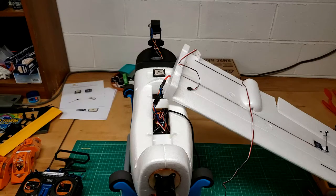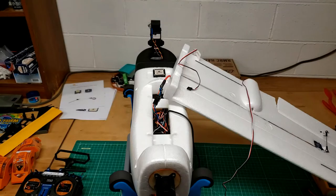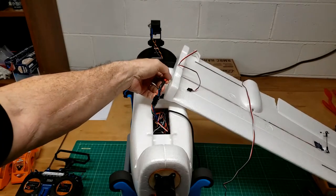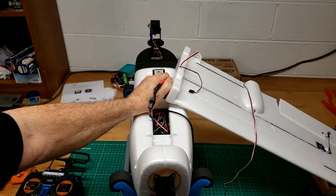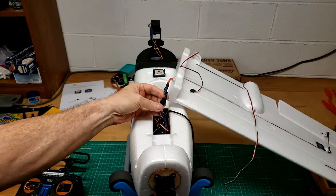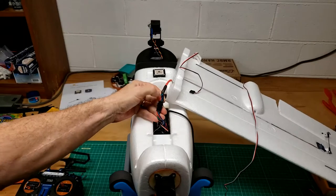Okay, so we got a 1.2 video transmitter right out there in the wing that has no lights. And this is that really stiff cable, although it's only four conductor, this was much stiffer than the six conductor cable I used. The wire gauge is bigger diameter, and remember I had this kind of a pushed pin in this red lead right here.